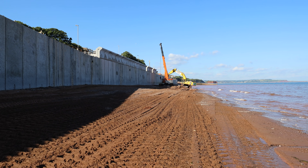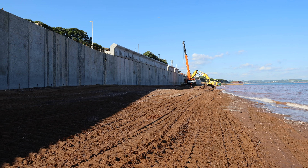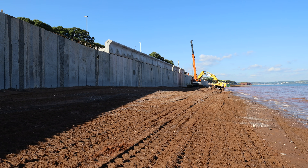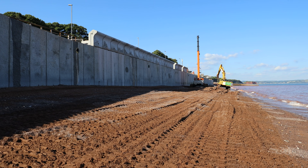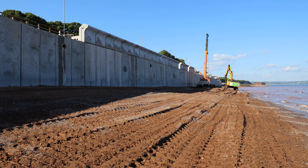There are some gaps in the recurve which you can see up there. The reason why there's a gap left is because that's a special unit — we have viewing platforms as we walk through the length of the job. The units are tapered and they take a little longer to manufacture, just because the mould is a little more complex in terms of the dimensions and the geometry of the unit.